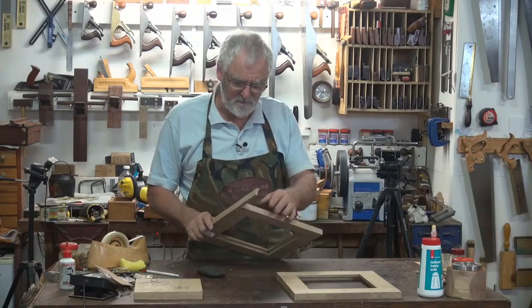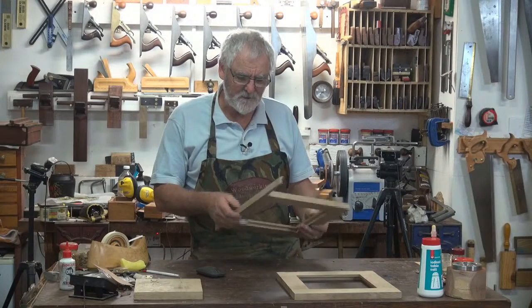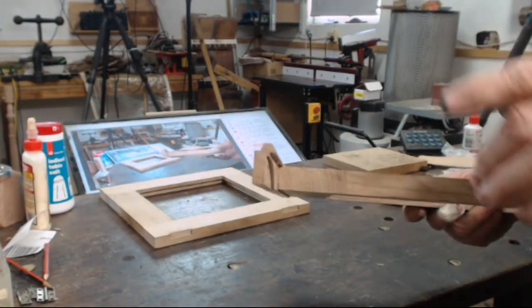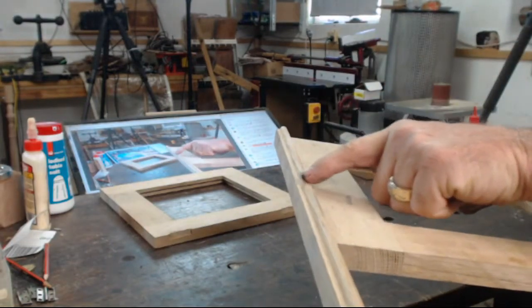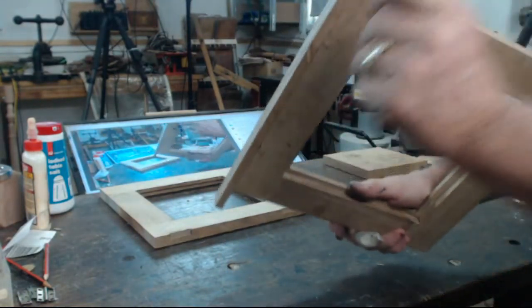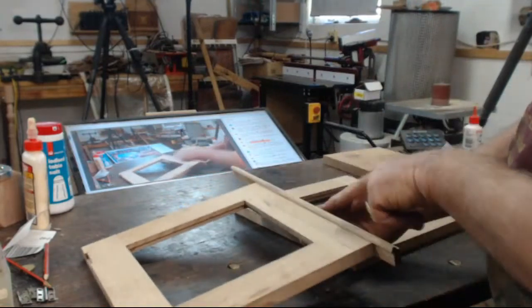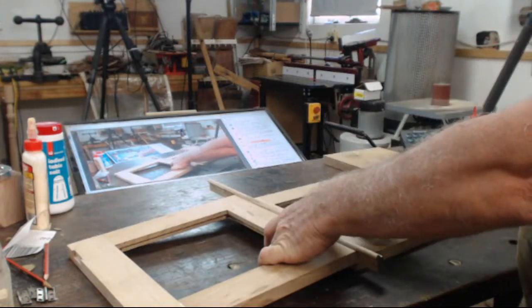Let's cut this off. And then, no, let's cut this out first. So what I did with this is a lip that I'm putting on the door so it doesn't jam. I'm going to cut this portion off here. Then we just got the round over happening. I've got to plane this at the back here and then cut a rebate along there. Then when these doors are shut, this bull nose here will act as a lip to go over the join.